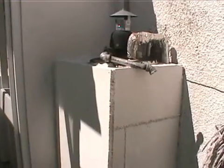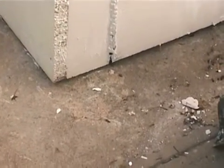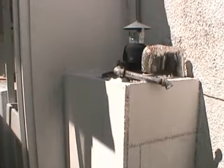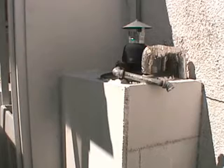I lined this water boiler with polystyrene a couple of years ago and it has perfectly withstood sunlight, rain and even hail. As you can see, I left a space of about half an inch at the bottom to provide an air inlet for combustion. An important thing in the case of water boilers is preventing the insulation from being directly exposed to the heat from the boiler chimney since heat damages polystyrene.